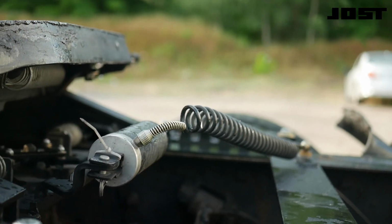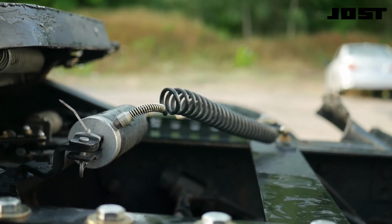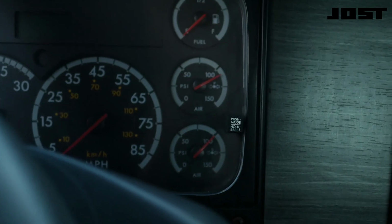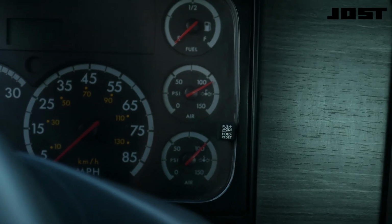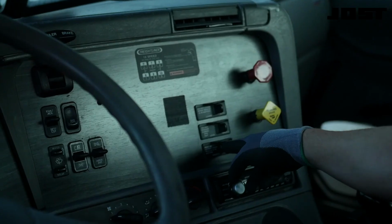Actuated air cylinders will hiss. There is bypass built into the piston. Check the slide release air cylinder for proper operation. Check for adequate air pressure. The secondary air system needs 90 psi to operate the slide release cylinder.